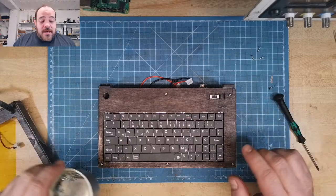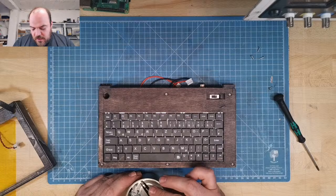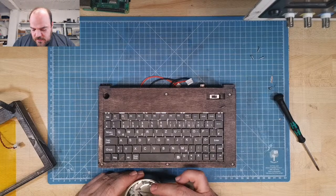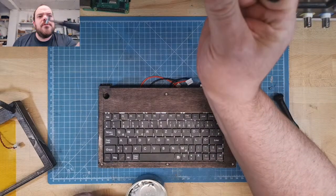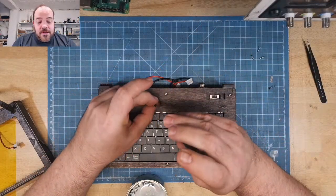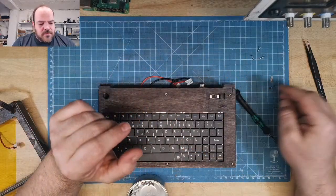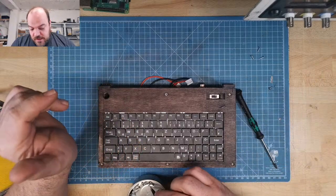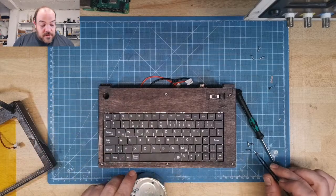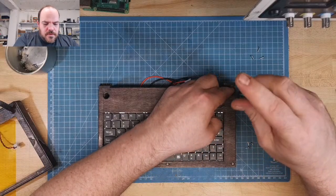Get five screws. And here is a trick, because underneath is something and a long screw can cause damage. But I don't need this very short one. I need the one that I cut. There. Very important. One shorter screw goes here in the middle. Otherwise, it can cause problems, because then it sticks through and you could screw into the HDMI cable somewhere else. Not a good idea. So, and then I need four more normal size. I have the small ones, but how do I forget where I use the small ones? Oh, we'll see.